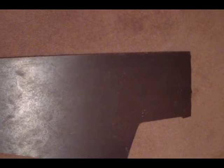This is a nice straight edge, and we want to line it up perfectly with the edge where the bevel is, so that when we push it down, this one side will not require any routing at all. It'll be almost perfect, and it'll be okay if it hangs over just a hair, or if it's back just a hair, because there's going to be a bracket there that holds the marquee in place. Probably the best thing would be if it's back just a hair. Don't really want it to hang over much, but we'll find a way to get that lined up.